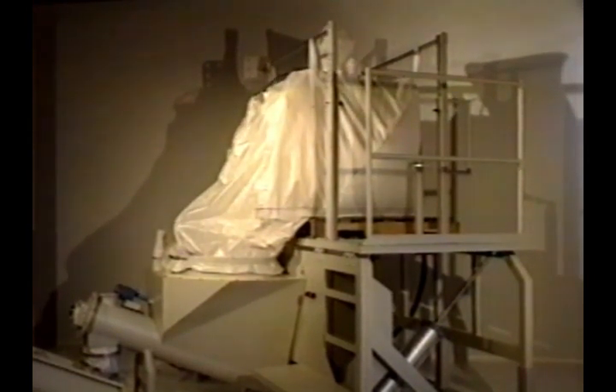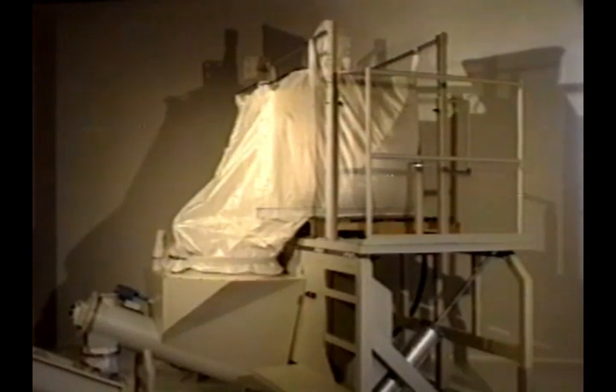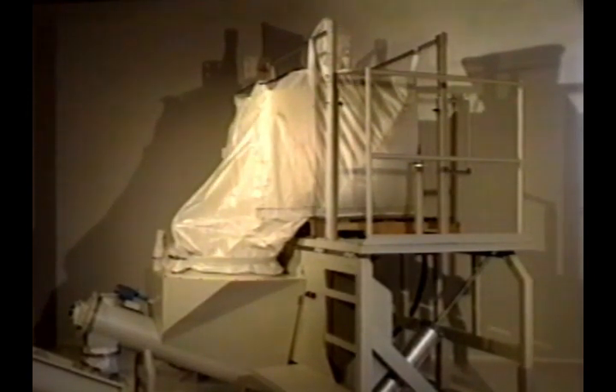Just as in the standard bulk bag, the material in our bag has formed an almost solid mass. As the inflatable liner in the bag expands, its gentle movement begins to break up and fracture the compacted material. The material continues to break apart as it falls into the hopper of the unloader. Once the probe is satisfied that the hopper is full, inflation stops until the probe senses another low-level condition. The inflation cycle is repeated automatically until the bag is empty.